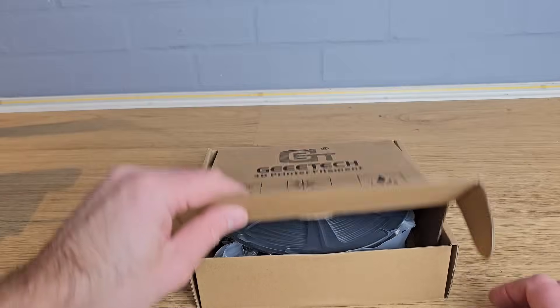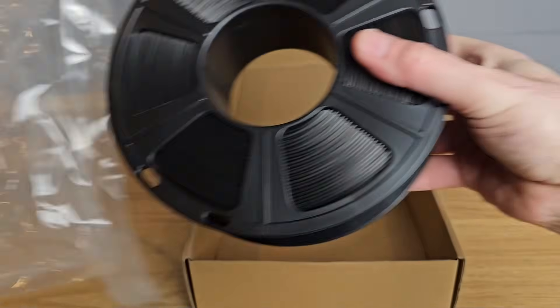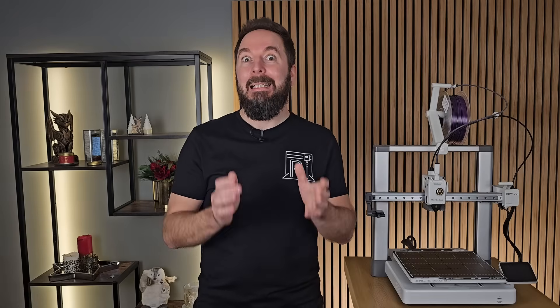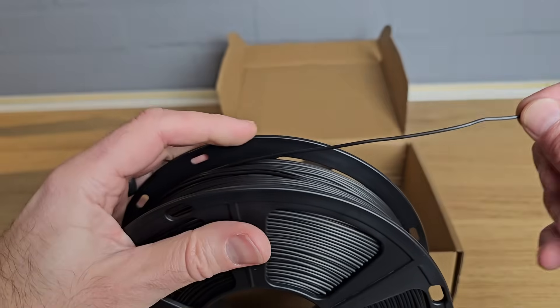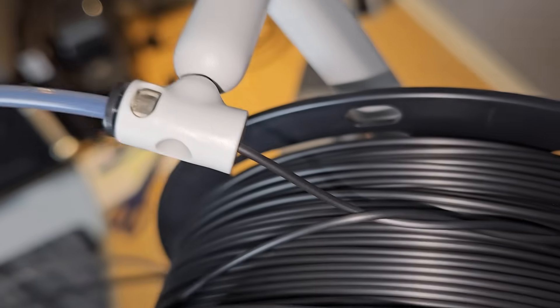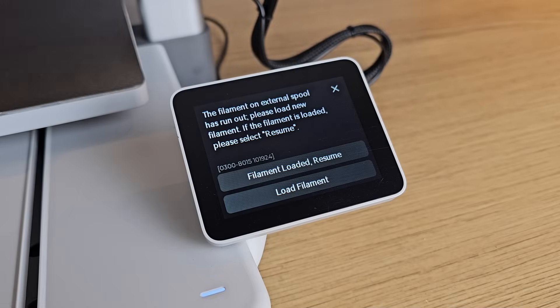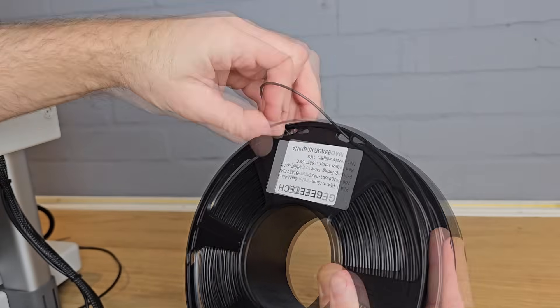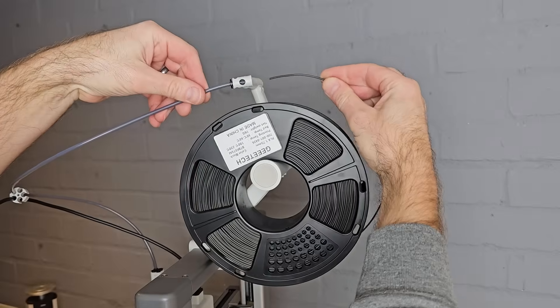If you've made it to this point, you're doing great. While the printer is getting itself ready, it's time to get your filament open and ready to use. Filament is the string-like material that 3D printers use — it comes supplied on rolls and you need to handle it a little bit carefully to avoid headaches. The single most important thing is to keep hold of the end. Filament needs to unwind cleanly as your printer pulls it, and letting go of the end will very likely allow it to tangle. Always hold onto the end or keep it tucked into the holes on the side of the spool until you're about to feed it into the printer.